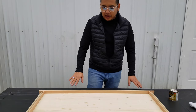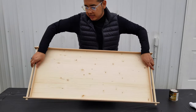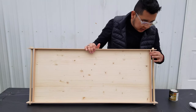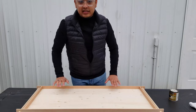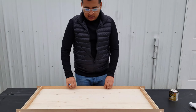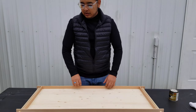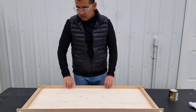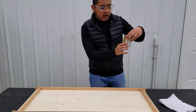Welcome back — I left it overnight to dry and removed the tape. On one of the sides it was still loose so I applied some more glue. Now we're getting ready to stain. Before staining, I gave it a light sanding again, especially in the areas where tape was — I want to make sure there's no residue. Also, just lightly sand the edges to avoid splintering your fingers. I'm using Minwax Poly Shades Classic Black — I love it because it's stain and polyurethane at the same time, so I can do it in one step.